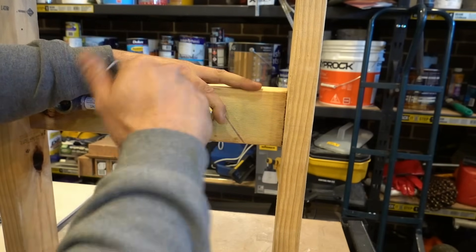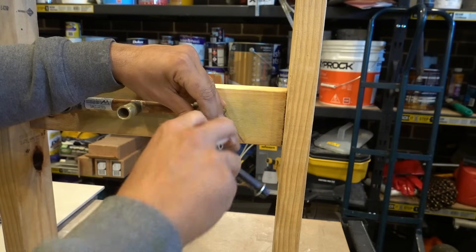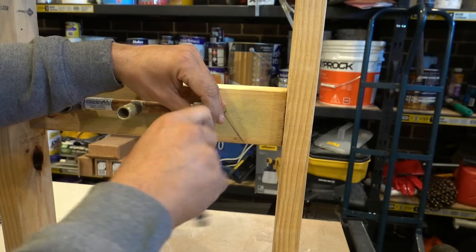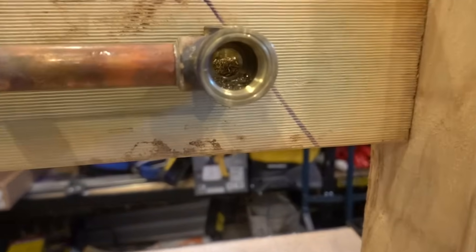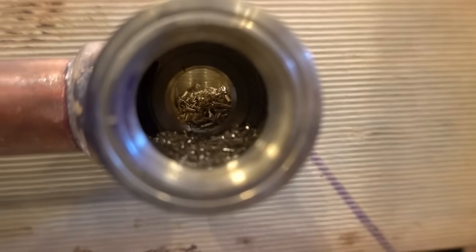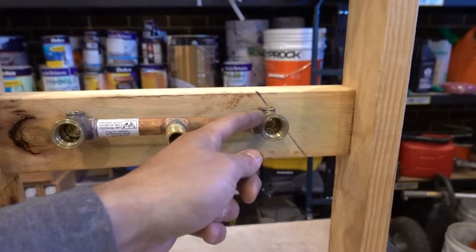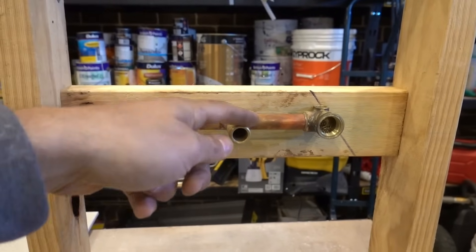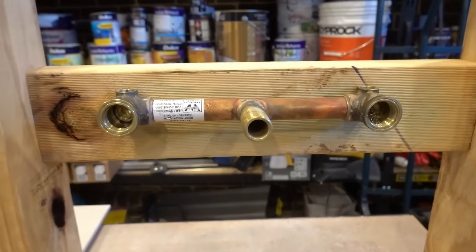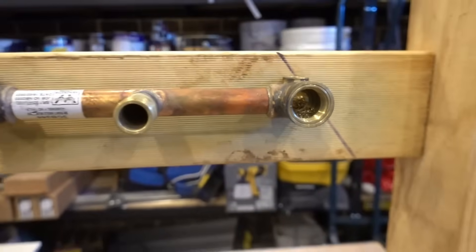Once that's done, back it off and remove the locking screw. We've now tapped out our new threads — you can see it's threaded all the way through. We've got shavings left behind, so you need to flush these out again. Turn on your mains; you can put the spindle in without the washer this time to flush out the system. Make sure you remove the aerator or shower head — whatever outlet it's connected to — to flush out all that debris.